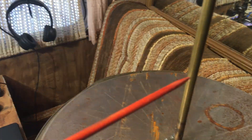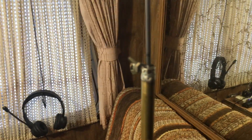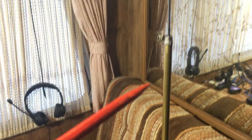This is brass tubing. I soldered on a PL-259 connector, and that brass tubing is soldered under there. Then I put a shaft collar, they call it, and I soldered on a wing nut so that I don't need tools to adjust it. That's how I did that — I did a video on that before. The SWR bars are real good.